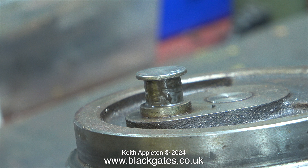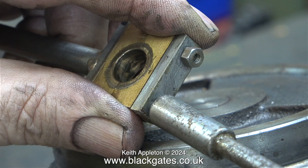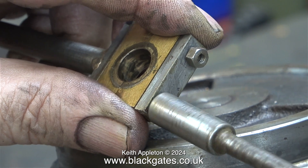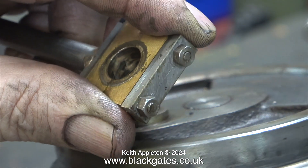One idea I've used in the past is to drill a hole in the centre of the crank pin, then drill a cross hole to the outside inner bearing part of the crank pin. You can even make fancy end caps machined to look and work like oil boxes, or drill a hole all the way through the retainer end cap and the big end bearing to let oil in that way. But it's quite difficult to get your oil can into the right place, especially at the front where the cylinders are definitely in the way.